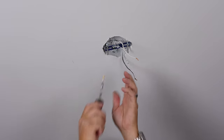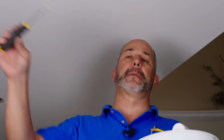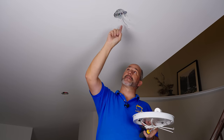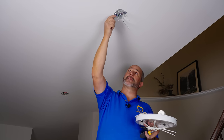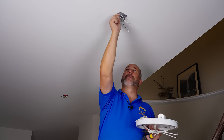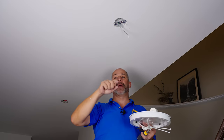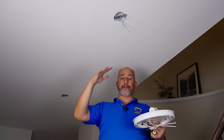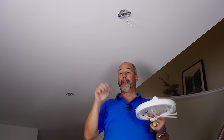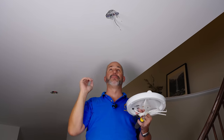Let's connect our ground wire — done. People wonder about ground wires. This wire is wrapped around a steel screw, screwed into a steel box, attached to the bracket with a steel screw — so the wire itself has no remaining value; it's connected through the metal. The ground wire goes all the way through the house down to the panel, and from the panel outside to a big steel plate about a foot deep and eight inches wide that's pounded into the ground. That's literally the ground wire. Any time there's a short, it's attached to ground to keep things from blowing up.